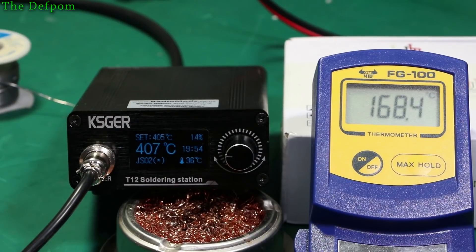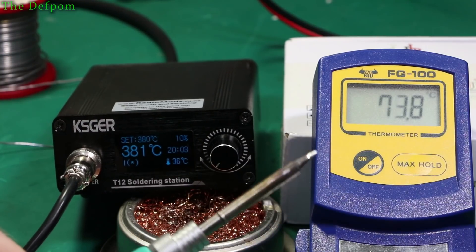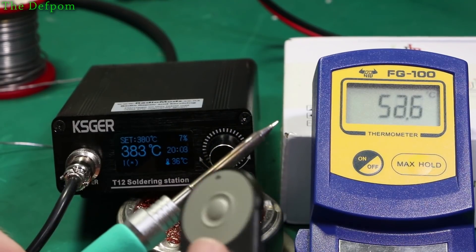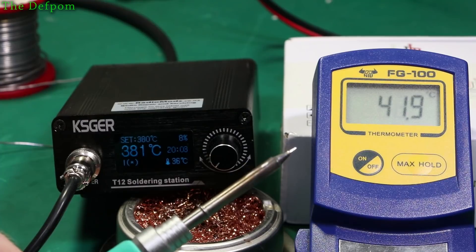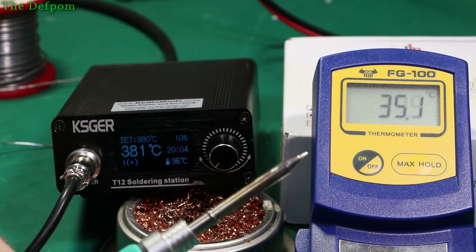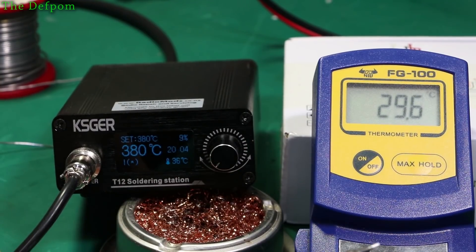I just calibrated the eye tip as well, which has got quite a fine point on it. This is one which I found performed really badly — it wasn't doing very well and used to struggle quite badly. I found out why: it's reading about 30 degrees out. So that really wouldn't help. I've done a calibration on it and it's now much closer.